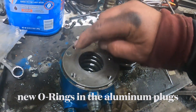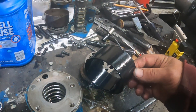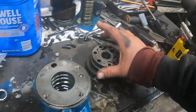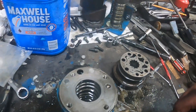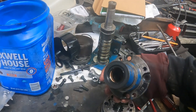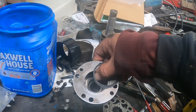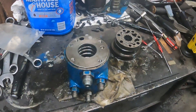I had to take all of them out. There's also a quarter-inch ball that had to be replaced — it got really hard and shrunk, and it was no longer seating. It sits on the outside of the gear drive. There is also a seal kit that goes up in this assembly: there's an o-ring down in there, a brass ring, another oil seal, and then a rubber component. That's what I've been working on. I'll get it all put back together and put it on the tractor.